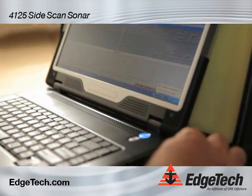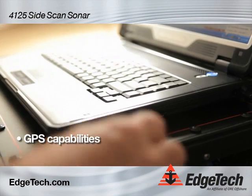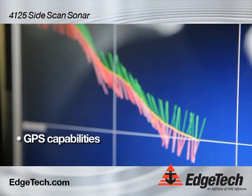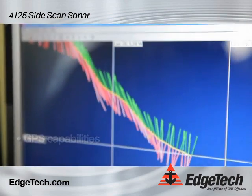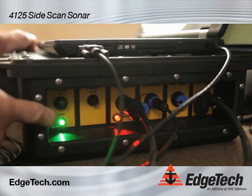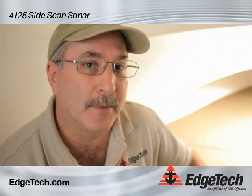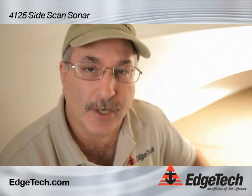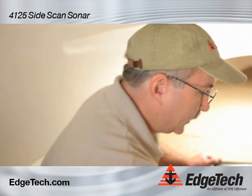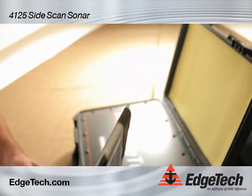Today I am going to use the LAN cable. I am also going to use the GPS today — we plug the GPS into the COM port. This allows us to get GPS positions on all targets that we find. System power turn on is right here. Today we are connected to a 12-volt battery. We have topside power and fish power. Now we are going to go ahead to the back deck to do a pre-deployment test. We use this test to check all the functions of the towfish before we put it in the water. I am going to use the wireless connection to do that, so we can disconnect from the LAN and go out on the back deck with the laptop.